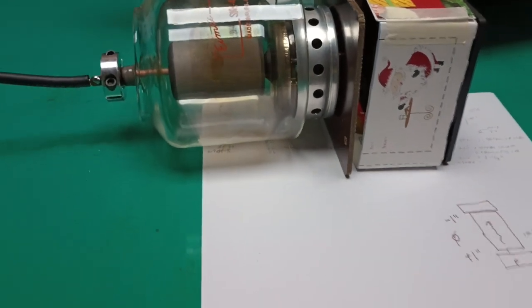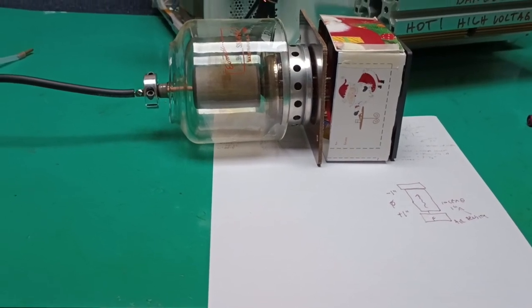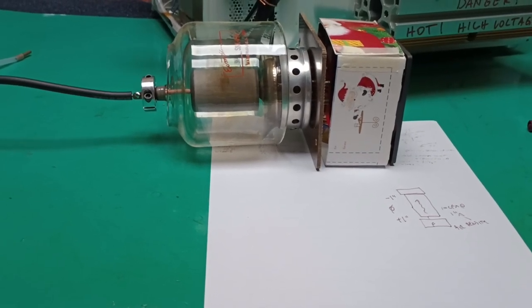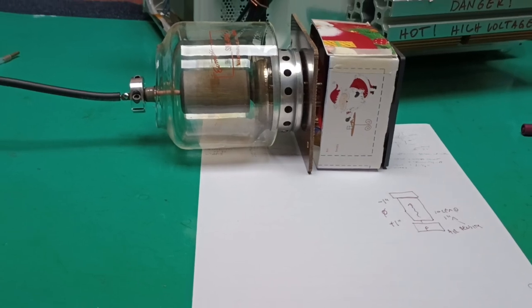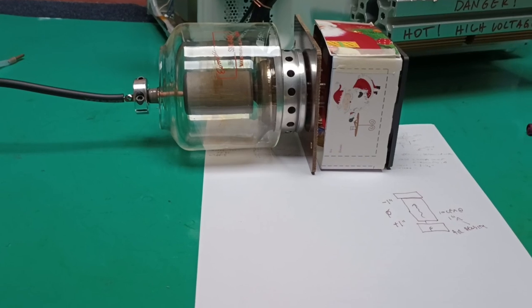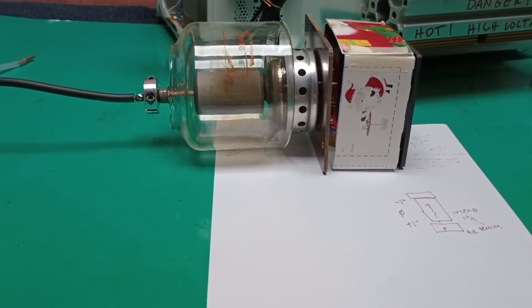There's a website in Germany. I don't recall the name. I'll post it in the video description. It's an excellent document on fans and airflows. And they say it's acceptable to put 2 fans in series, one pressurizing the inlet of the other. The pressures will add. It says it's not acceptable to put 2 in parallel because one will do something the other won't.